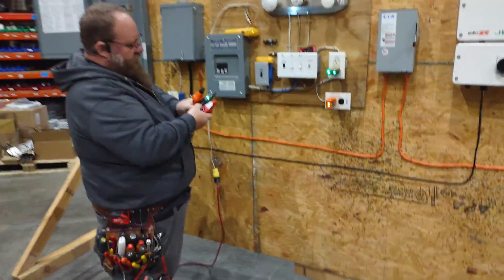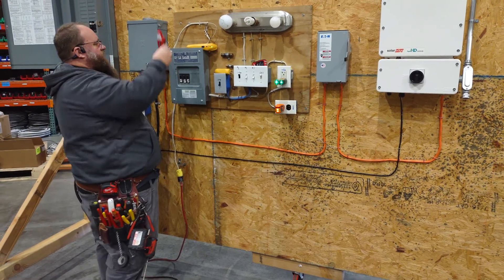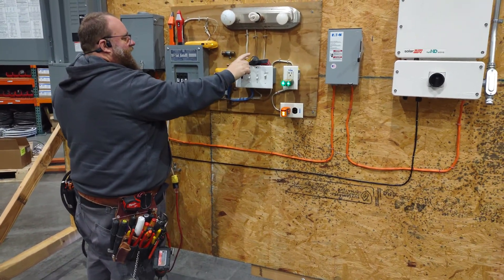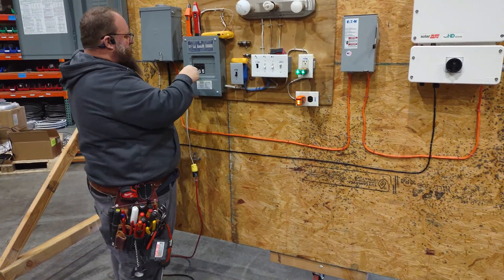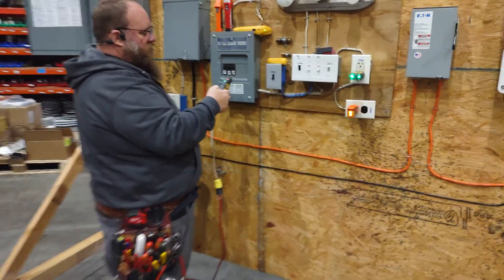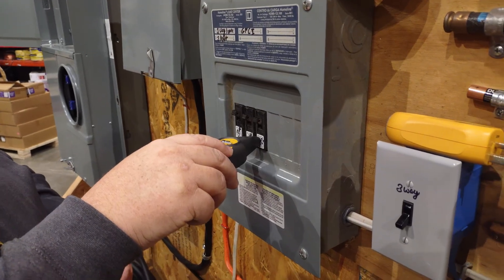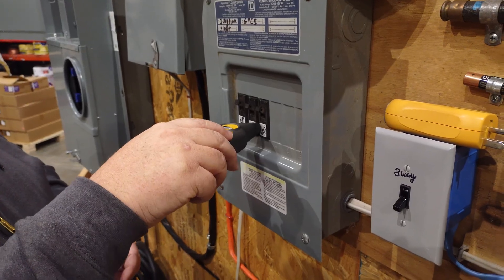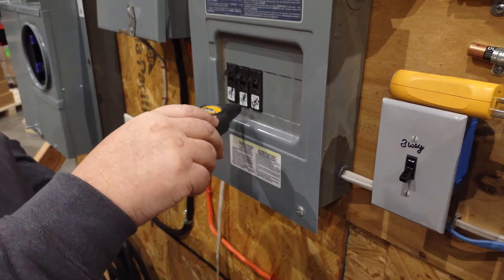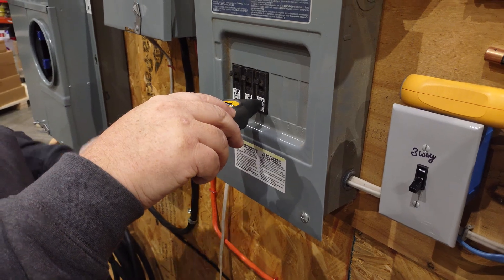Push and hold to turn off and it beeps. There are a couple of other cool features in the other two versions. The biggest thing I'll tell you with this one is making sure you are dead flat on the panel and then swiping it across. There will be a spot where even if you're on the right breaker but a little off, it won't catch — you have to be dead center on the breaker. Sweeping back and forth will help with that. If you sense it's not catching, just hit the button again to reset. Sometimes it will lose its connection, and all of them will do that.